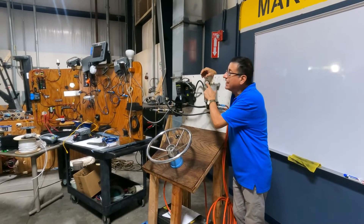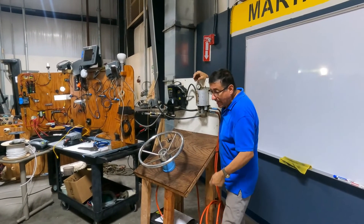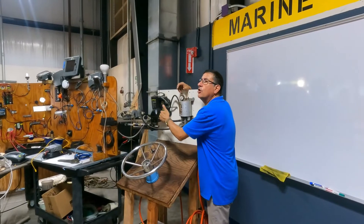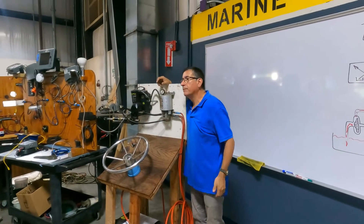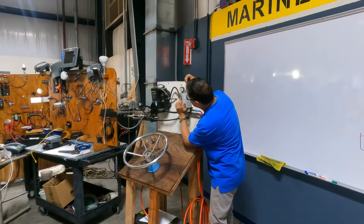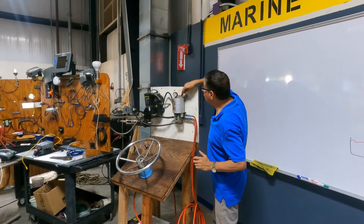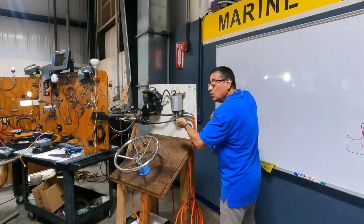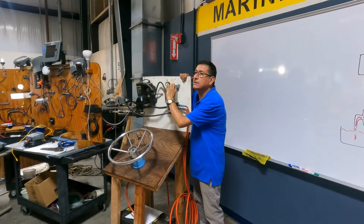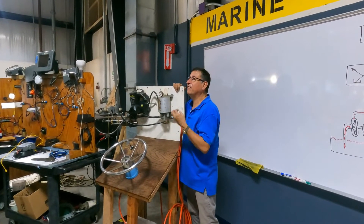Suppose I found that this gauge goes down to five PSI — it's because I have a leak. I follow the lines and I find it. I tighten or replace the fitting and fix the problem. Then I open this fitting, add more fluid until the middle of the second window, tighten the fitting again, introduce a bicycle pump, and introduce air. Where will that extra air be located? In that pocket in the reservoir. The air will stay there — it will not mix with the fluid and create bubbles.